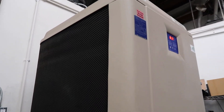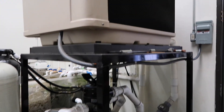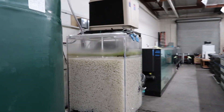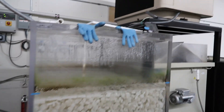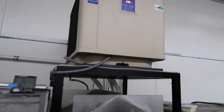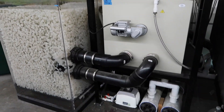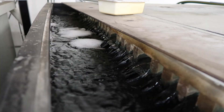What are these big blocks up top? That's a heat pump. So it heats the water — it's kind of like a reversed air conditioner. It draws the heat from the room and puts it back into the water. It's supposed to be really energy efficient, and I believe it is because my electric bill has come down so much since I started using these things. Sometimes people find it kind of weird because they say it uses electricity, so shouldn't it be using a lot? But it doesn't generate the heat — it draws the heat from the surrounding area and puts it into the water.